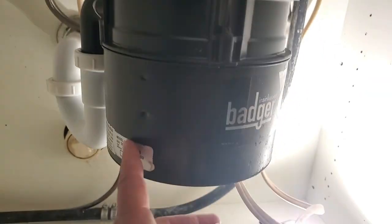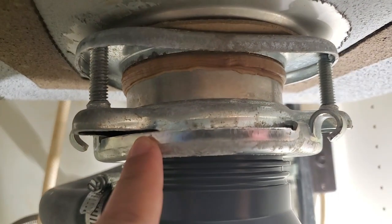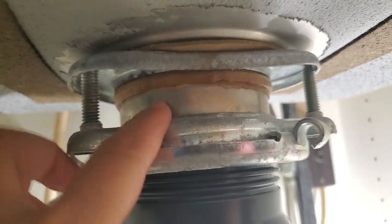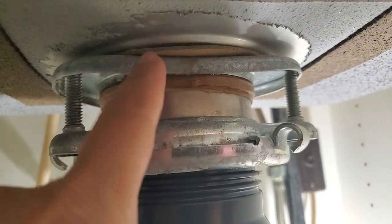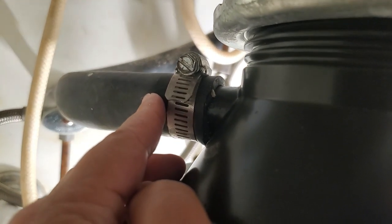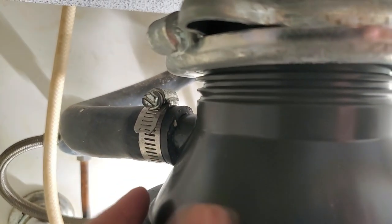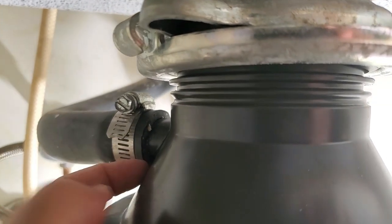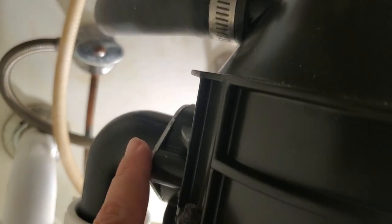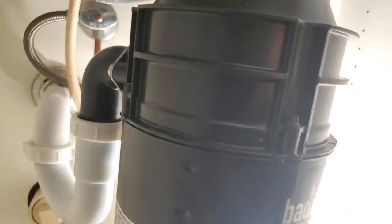If you've never done this before, this is obviously your garbage disposal - it's hooked on to this contraption here. That's some plumber's putty and the ring. This is your dishwasher connection. If you don't have one, you don't open this up - it's sealed when you get it brand new. If you do have one, you have to make sure you open it up otherwise it's gonna flood. This is your drain that it goes into - the waste will be pushed out.